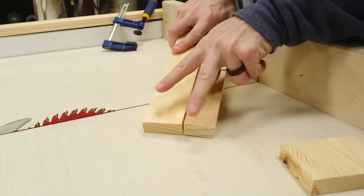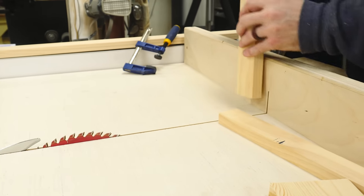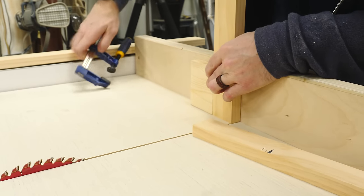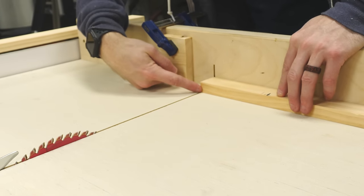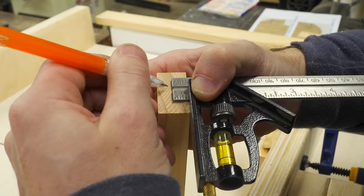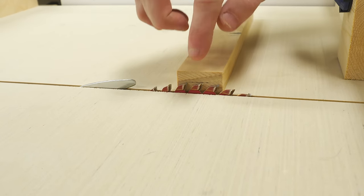I'm working with two different thicknesses of pieces — if you had the same thickness for the whole frame this would be even easier. Basically I need to cut away this thickness from this piece, so I'm going to set it up against the beginning of the cut where the blade hits and set up a stop block over here. Then you take the piece against the cross-cut sled and run it through the saw, cutting away half the thickness of this piece, then move it over and over until it hits the stop block. Then you've got that notch cut out of the bottom. I've got this marked at half thickness and I'm going to lay that down against the teeth to confirm the blade is in the right position.